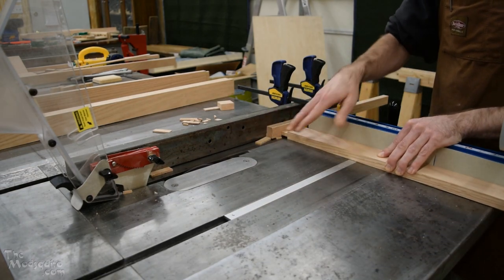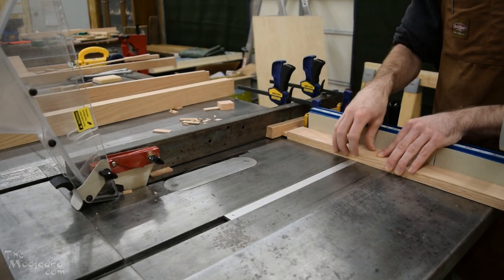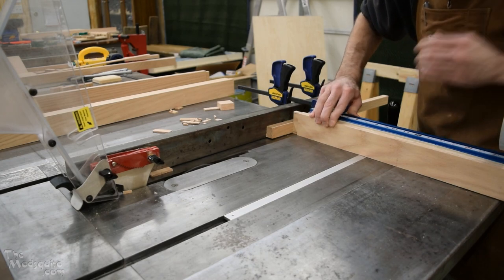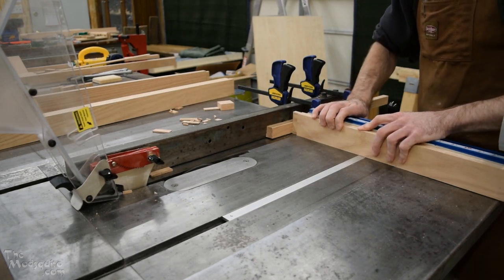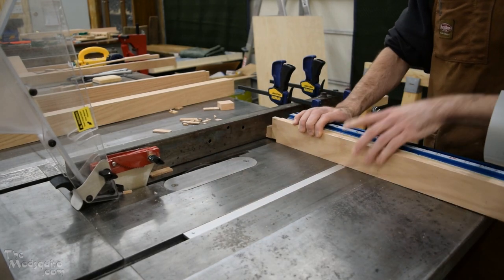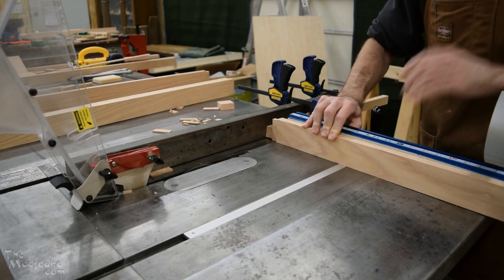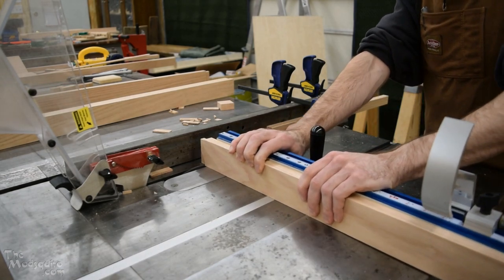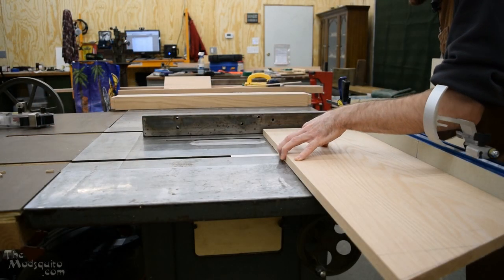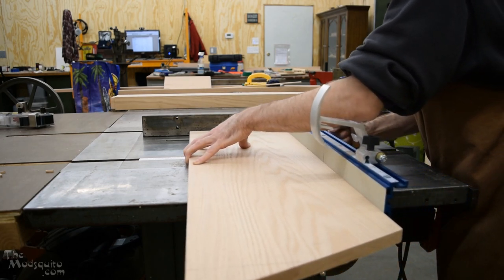And I don't have to worry about the workpiece being slid against the fence as I move it forward, and avoid any of the risks of a piece getting pinched between the blade and the fence and getting thrown back at my face at a very high rate of speed. Something I've been able to avoid so far, and I'm going to try to make it my entire woodworking hobby career avoiding. Highly recommended.